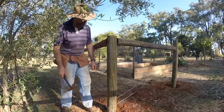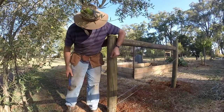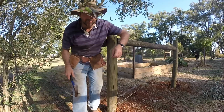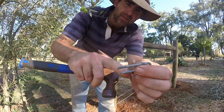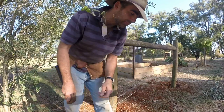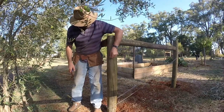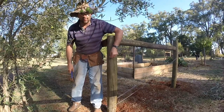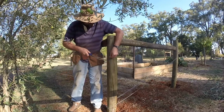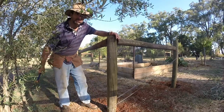When you're putting a staple into a post, it's really important not to put the staple straight up and down, because you'll see there are cracks in the post. What happens is you open up a crack in the grain, and the staple has these special barbs on it. The barbs don't bite into the wood — they just sit in the crack — and then the staple can be easily pulled out. So always put your staples on a slight angle. If you can at all, bridge a crack so that you know you're going into wood on both sides. Get your staple set up and then just gently ease it in.